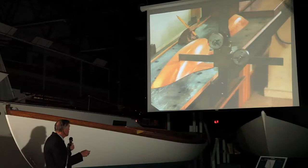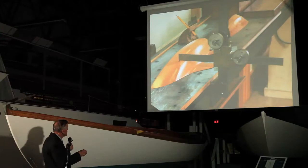If you're doing the stern of the boat where the shape's coming down there, you use this corner here, which you might call the northwest corner. And yes, there are two scribe marks here so that you can correct for the fact that you're using one or the other corner. Then if there was tumble home on the boat — where in the offset a deck edge is less than it is some of the way down — you can use these back corners. And yes, there's a constant dimension of this block where you can correct the reading here and get the exact point for that as well.